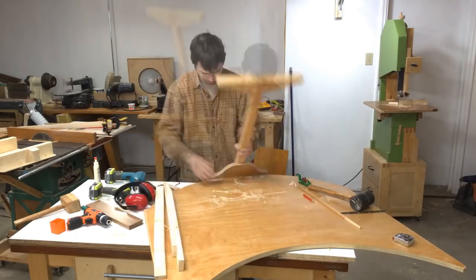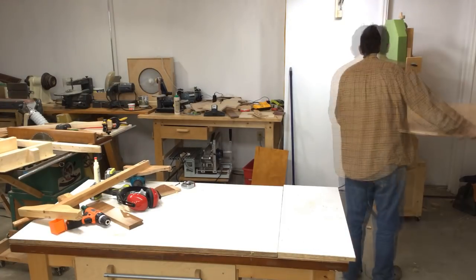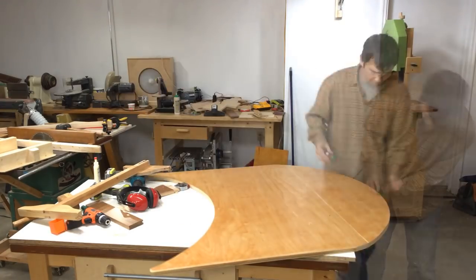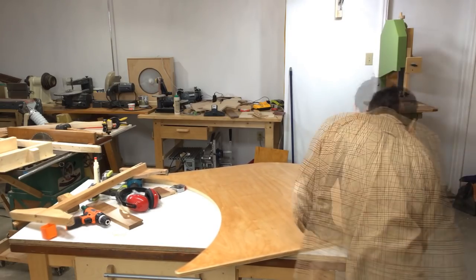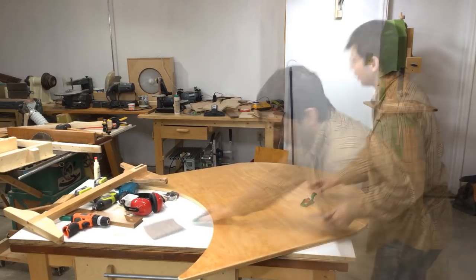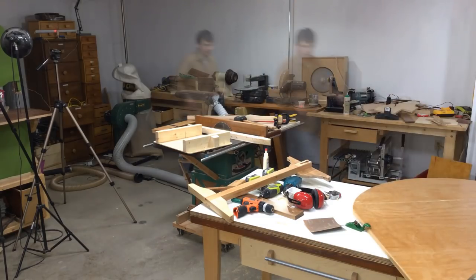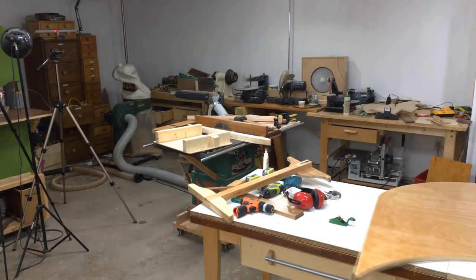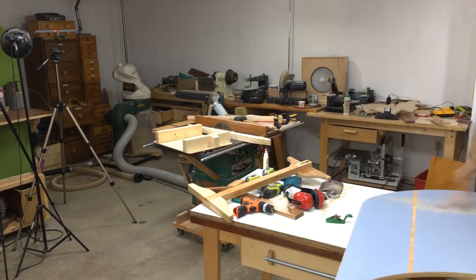I think at this point the glue is sufficiently dry that I can manipulate that top, so I'm cutting the corners a bit round to make that a continuous curve, and then using a small hand plane to bevel and round the edge a little bit, and then sanding it by hand. But then I decided that that wasn't enough, and I just put on the big belt sander, which made that curve much smoother. Now going over the edges again with a piece of sandpaper, and cleaning up the glue squeeze out on the table,